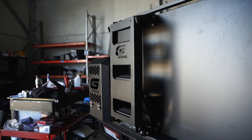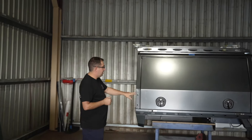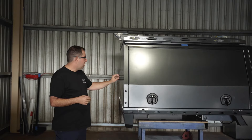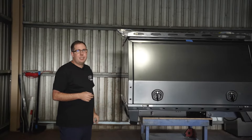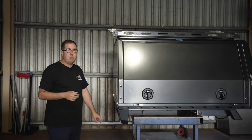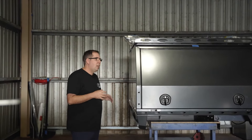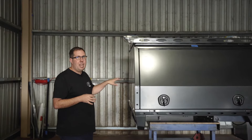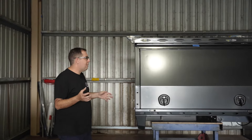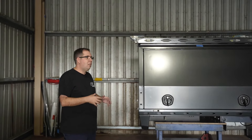We do make ladders to allow you to climb up the back and get things off — surfboards, ladders, whatever. You'll notice here that there's a couple of bolt holes — this is actually our lift-off point. On our internal subframe, we've got a 12mm plate that's actually welded inside to the frame and then stitched to the sheet as well. We then drill and tap these holes. The legs are bolted on so you're not having to worry about loading one side of the canopy up too much — they're always fixed to that canopy until they're actually removed.